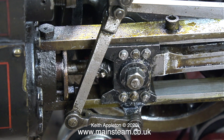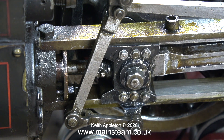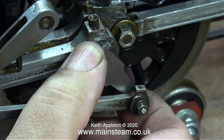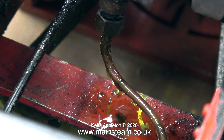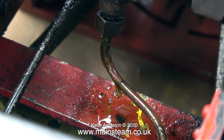Mechanically in certain areas it's still not too good. Looking at this clip, it shows the amount of play in the small end. The good news is that the valve gear is fully serviceable and doesn't require any more attention other than cleaning it up. Unlike the crank pin, which was originally loose — but I've now fixed this. And I also fixed the leak from the oil pump to the cylinder. Lack of lubrication is the very last thing that you want.